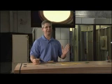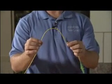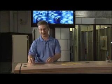All of a sudden there's a lot of construction, lots of 90-degree bends, and you're now in an environment where the subscriber has access to the fiber. The consumer may step on it, bend it, or do any number of things to it. Standard single-mode fiber doesn't take very well to bends — you'll have attenuation of the signal and potential service problems. ClearCurve fiber really addresses that; it's what we call a bend-insensitive technology. You can bend it much tighter than standard single-mode fiber.